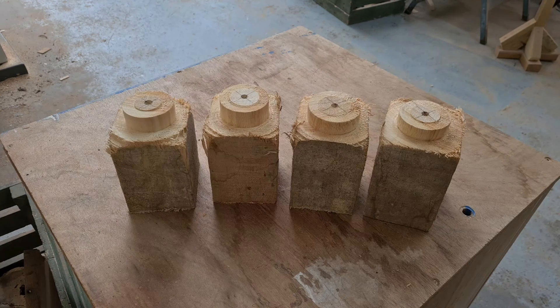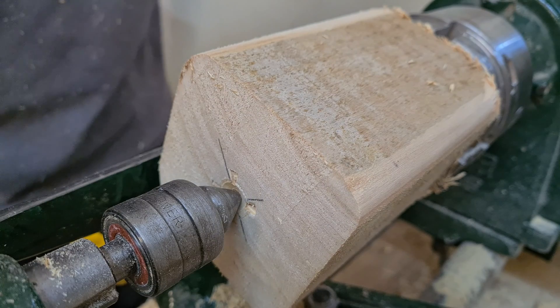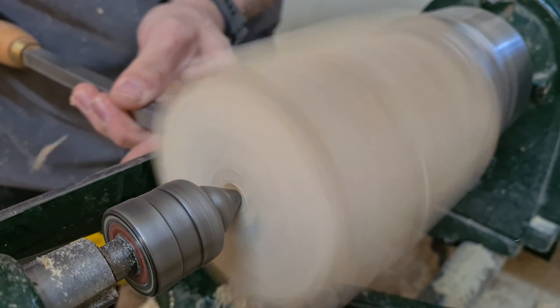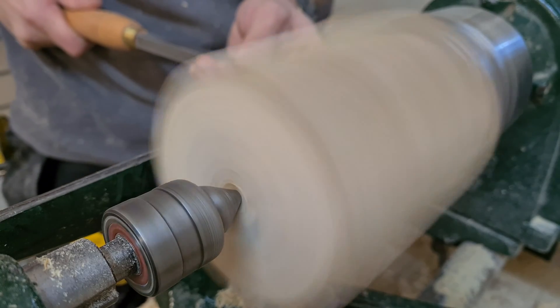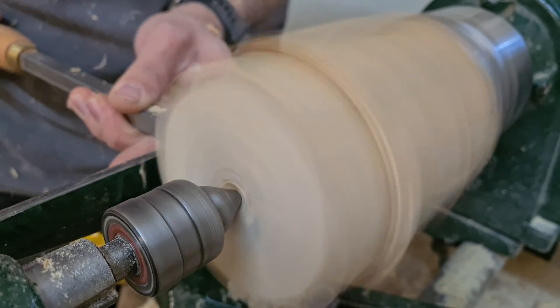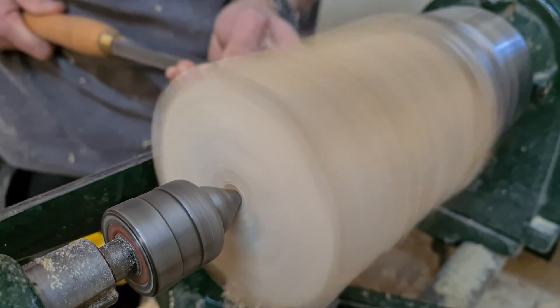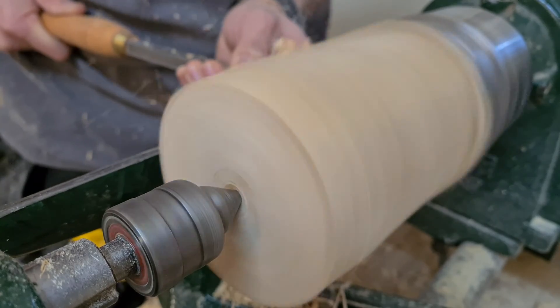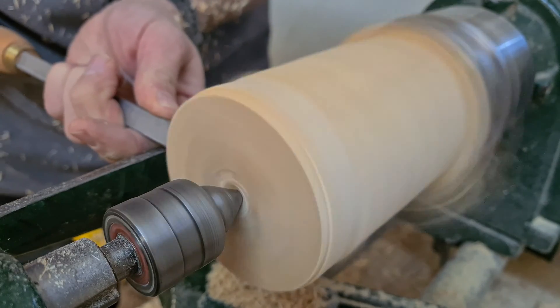This was scrap wood that actually turned to a beautiful finish. Definitely worth avoiding wood with knots though, as they tend not to cut easily with a diode laser, at least not without charring the surrounding wood. The slinky looks fairly straightforward to produce — just cut a continuous ribbon from a cylinder with a set chiral angle. I mean, what could possibly go wrong?